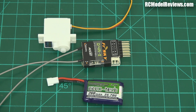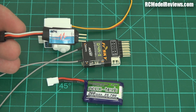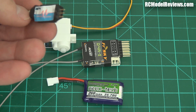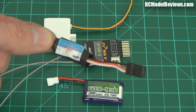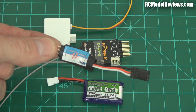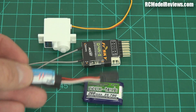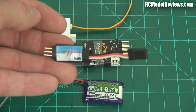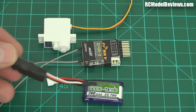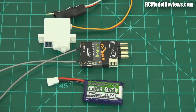There is a device that claims to do that — and there it is. It's called a boost converter. It takes an input of 1.2 to 4.2 volts — a single-cell LiPo or even a single well-charged nickel metal hydride — and turns it into 5 volts to power your receiver and servos. It's very small and very light. Will it do the job, or is it inviting just as much disaster as simply using a one-cell battery with servos and receivers not certified to operate on one cell? Let's throw it on the test gear.